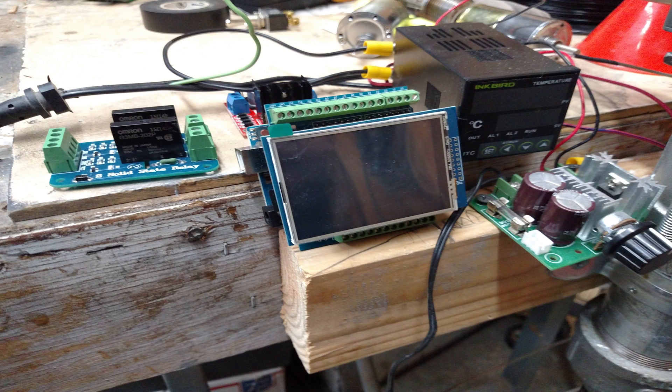So what are the main differences between the Multistruder and other extruders on the market? The first difference is the different type of controller the Multistruder uses. The two controllers on the right — the controller with the green board and the controller with the black housing — are used on the Multistruder prototype and on almost all other extruders on the market. The black housing controller is a PID temperature controller that controls the temperature of extrusion by reading off a thermocouple, then turning on and off a heater band to keep that temperature constant. The green board is a PWM motor speed controller board that controls the speed of the extrusion motor.